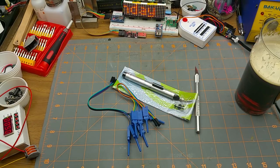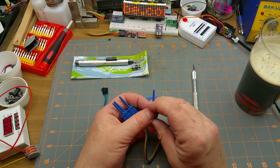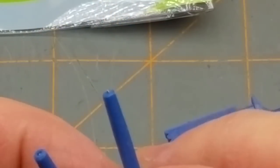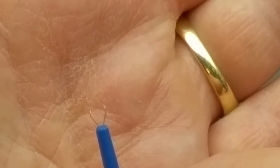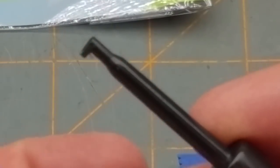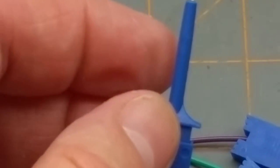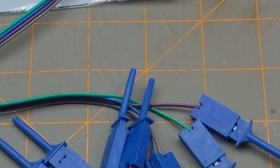Okay, that's the kind of vagueness we love and expect. Let's start here — these are little test clips. Zoom in so you can see them. They're nice and narrow so you can stack them side by side on a board, and the actual test gripper has tiny little leaf contacts. I've got some other test clips of this persuasion for grabbing component leads, but if you look at the difference between them, these ones are much finer pitch — they should be able to get onto the legs of a DIP IC.